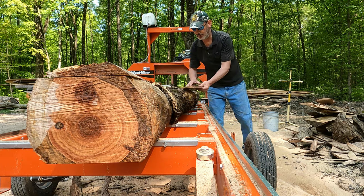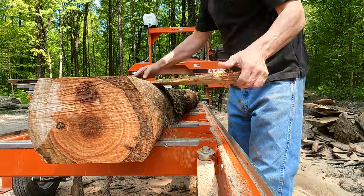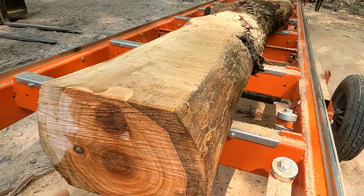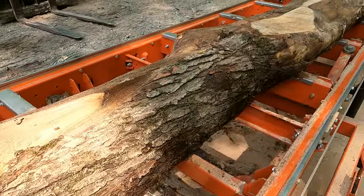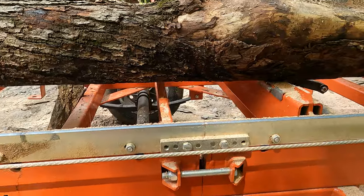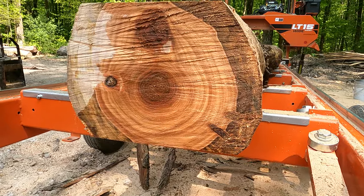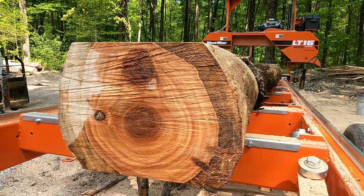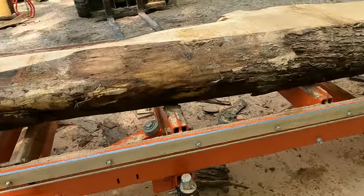So there's no way we're gonna get 2 4x8s. And as you can see, we ran out of log. That right there is 8 inches tall. So you'd have one here and then one here. That's not gonna happen because right there we ran out of wood. It gets too thin. I guess we could take 1 4x8 out of the middle. The top will be scrap and the bottom would be a 2x8 maybe. That might work. That's 2 hearts there. Look at that. Well, we got 8 inches. We're going to take 2 off the top, 2 off the bottom and see where that leaves us.